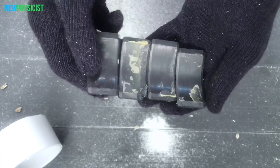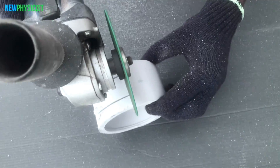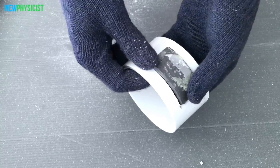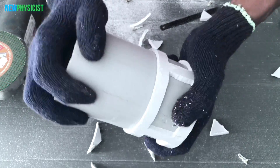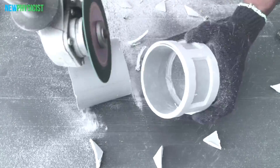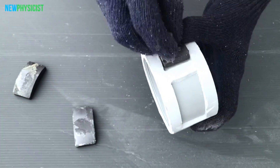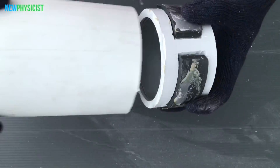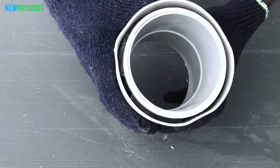To make the body of the dynamo, take a three-inch PVC end cap and remove the closed end. Then cut the outer to accommodate the magnets using an angle grinder. Carefully place the magnets in the groove in such a way that the poles of nearby magnets are different — north, south, north, south — then lock the magnets using a four-inch PVC pipe. You can heat the pipe if necessary.